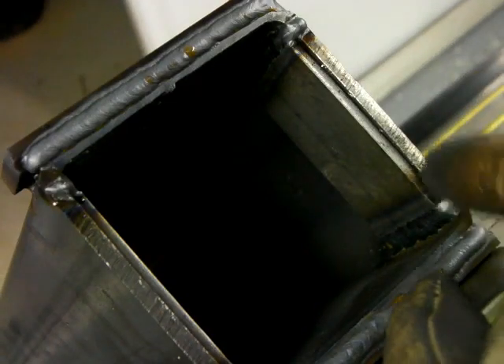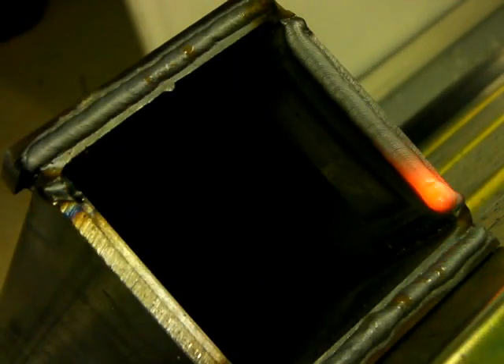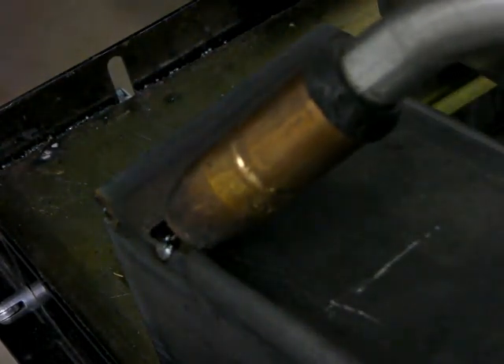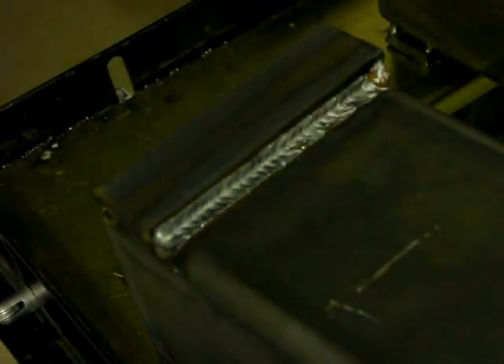For welding all the bar stock I tilted the table back even further, and the back fence gauge kept pieces from falling off. My main goal is to smoke them in there good and hot since it's all getting milled off flat anyway. On the 11-gauge stiffener plate, instead of chamfering, it's recessed back about 3/32 of an inch, then I go really slow and intentionally put a high crowned bead that'll mill off and leave plenty of surface area — it's all going to be milled flat, drilled, tapped, and the cover plate will have an O-ring, so it needs surface to seal to. The final outer weld does need to look good since it won't be milled off, so I set up around 20 volts, 250 inches per minute with .035 ER70S-6 wire and tried to make it look nice.